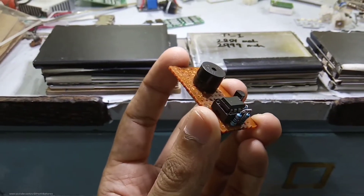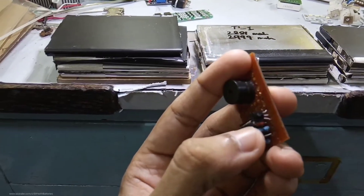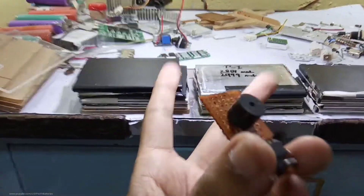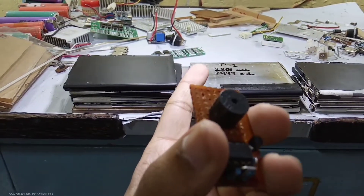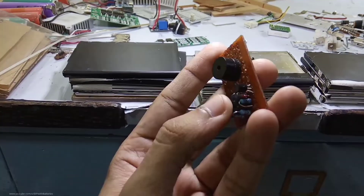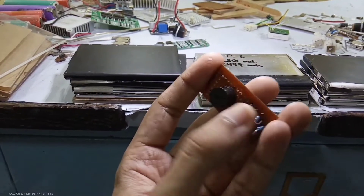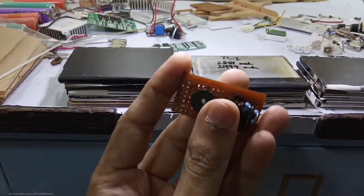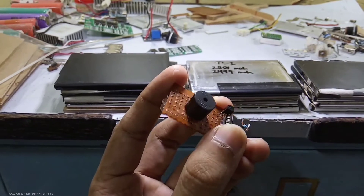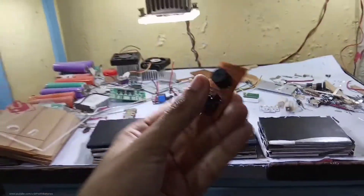I designed this circuit to work with only the solar panel, not from a 12 volt power source, because I connected an extra 5.1 volt zener diode in series with the 12 volt zener diode. So when the battery is fully charged at 12.6 volts, the BMS disconnects power from the solar panel, and the solar panel's 22 or 20 volts open circuit voltage breaks the zener voltage and passes to the base of a BC547 transistor. This allows power through the 555 timer IC connected in astable mode, which makes a bleep sound and indicates via a small LED.